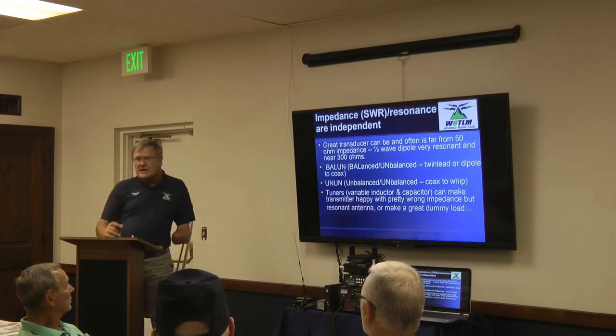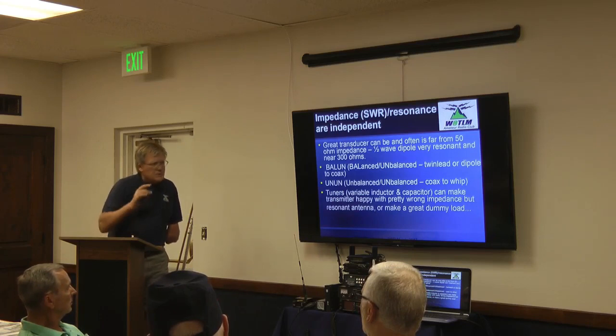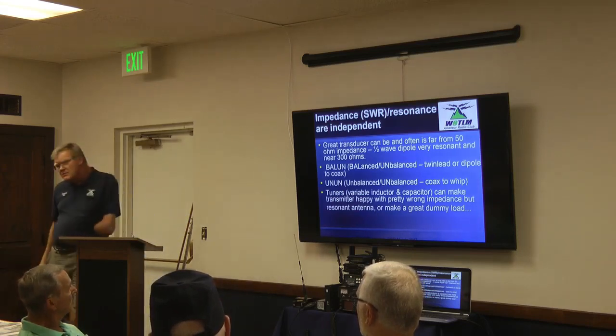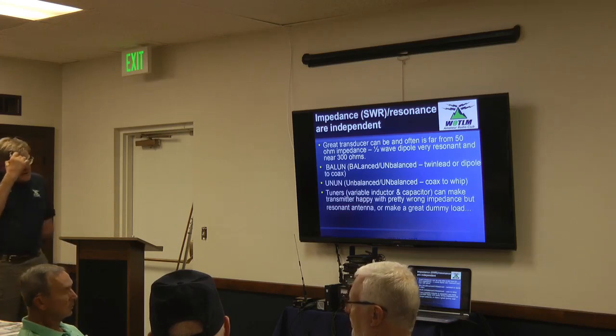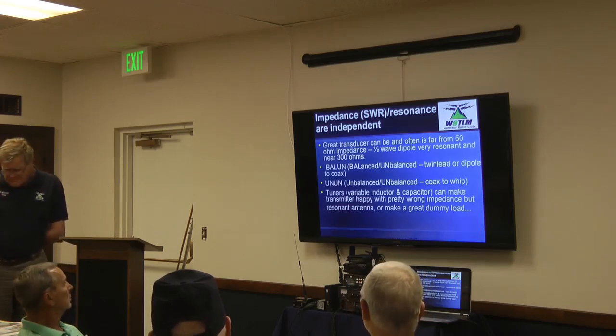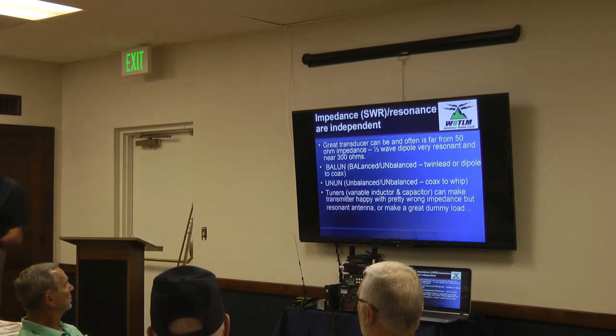And most antennas that you get resonant are not going to be resonant at 50 ohms. So you have to do something to get your transmitter happy with it. And it's very possible to do. We use things called baluns. Mike did a presentation on baluns and ununs a while ago, and I'm not going to go into it. That's a 2-semester college class. I'm not going to go into a lot of detail on it now, but don't be afraid of them.